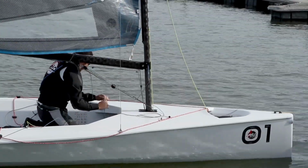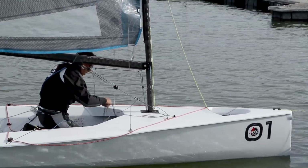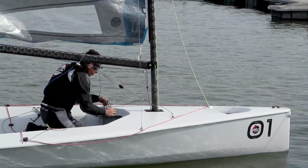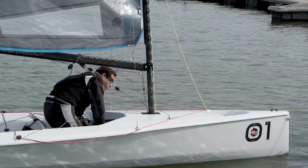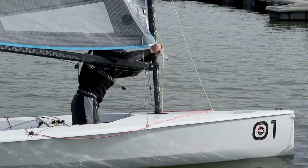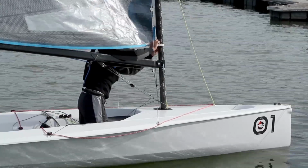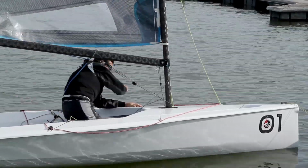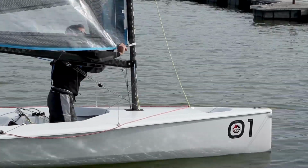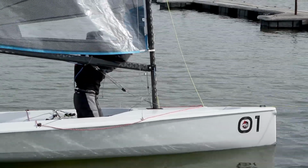We just put the eye splice in one of the hooks of the roof rack, and just stuff the messenger part of the halyard. Then we connect, making sure that we do this one in front of the mast but behind the spinnaker halyard that's coming in. Now we're just going to install the Cunningham hook. Little blue line here.